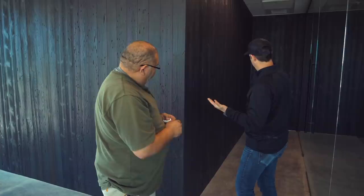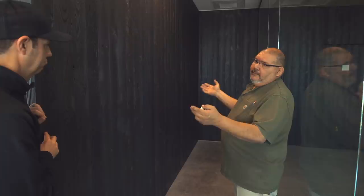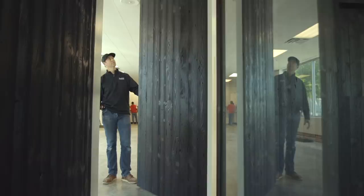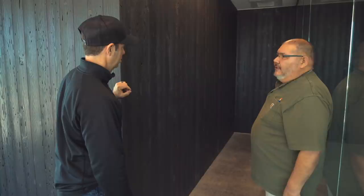Going down this hallway, you can't tell whether there's a full board or not from the main position. We had to create something for that door to butt into, so we didn't end up with a full board, but once you get to that corner you really can't tell because you have two boards coming together. Tell me about that pivot door — did you manufacture it or work with one from a mill shop? We built that door out of 10-foot-long, four-foot-wide MDF. It's a heavy door — three full sheets of MDF glued together. In the center I ran 10 inches all the way around with some pieces in between, leaving some hollow spots to try to get some weight off of it.